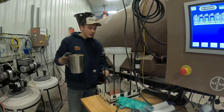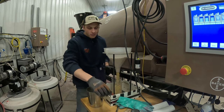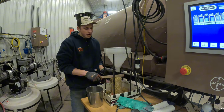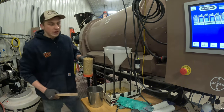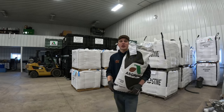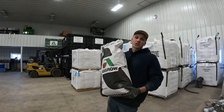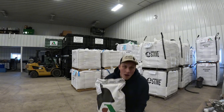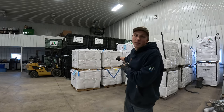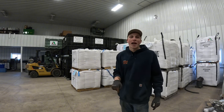Because every seed has a little bit different size and different humidity when it comes in to being treated, we need to calibrate that to our treater, which I'm doing here with this cylinder, and we'll take a scale weight over here. By inputting that calibration container on the treater, I now have it calibrated for one individual bag of soybean seed, which contains 140,000 seeds. But we're not treating per one individual bag — we're treating based off these large mini bulk bags which contain 40 individual small bags.